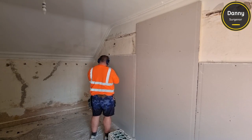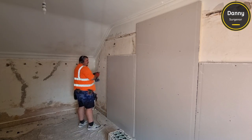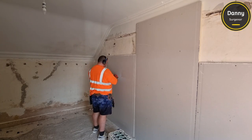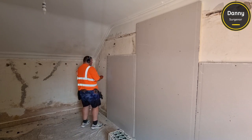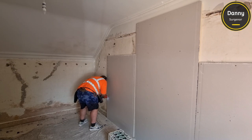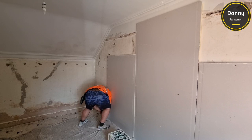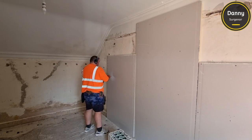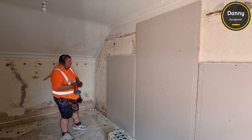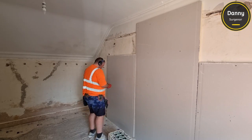This is an upstairs room, so we're pretty sure it's not going to be damp. We check it for damp, and if it's not damp, then we just stick the boards to the wall with non-expanded foam and then fix them with mechanical fixings afterwards. If the wall's damp, then obviously you want to build a frame off the wall. You really want to get the damp solved first, but if the client doesn't want that, you can build a frame on the wall with DPC, or you can build a jig frame - a metal frame away from the wall.